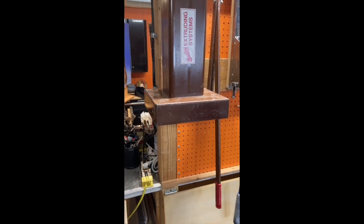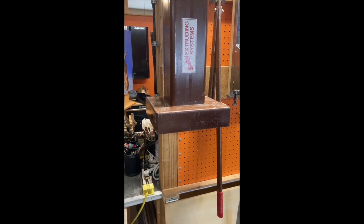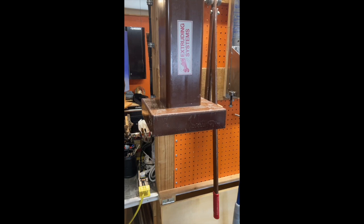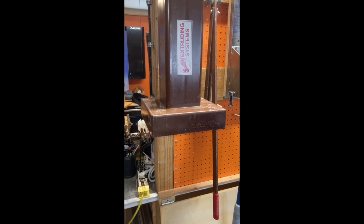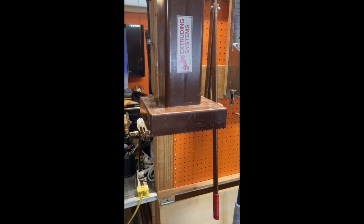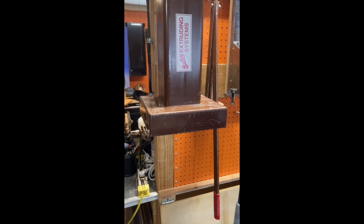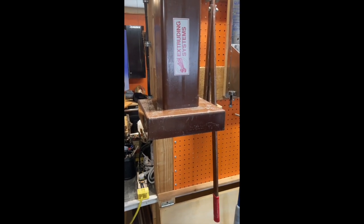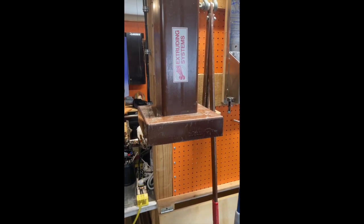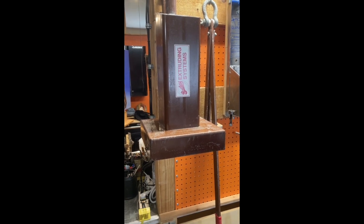Now then, some of you are wondering, well, what's the point of this? Well, the idea is that installed, these frame pieces displace a lot of the area that would be filled with clay. So when you're using smaller dies in the Bailey, you don't have to fill the expansion box completely with as much clay. And by that, you don't have as much to clean out when you're finished. So that's what we're trying to do here, is make it so you don't have to go through so much grief to use this, what is a really cool extruder.